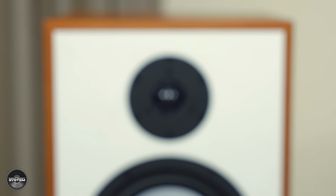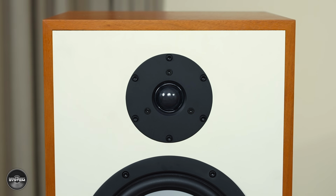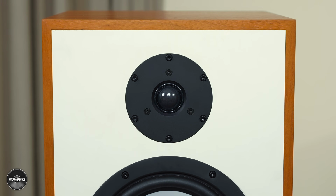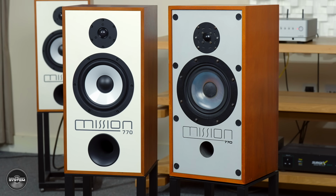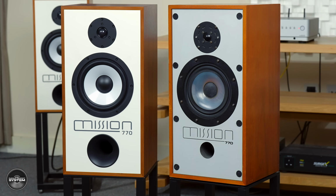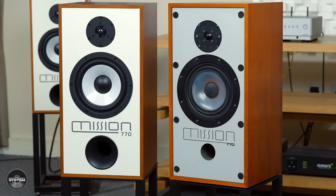The treble unit, we could make a big advance on that because we can design what we need. This treble unit has a rear chamber which lowers its resonant frequency well below the crossover frequency. The important aspect of that is that we can now use the crossover to define the slope rather than relying on the drive unit to define the slope. Instead of the plastic dome that was used originally, we have a coated silk dome. The reason for that, again, is to make sure that the dome behaves in the way that we want it to. It gives a much clearer, lower distortion sound than the original plastic. So we've made big advances in terms of the drive units.